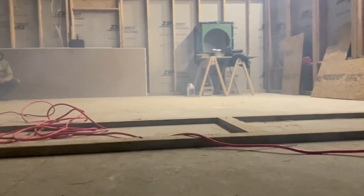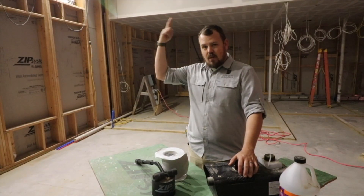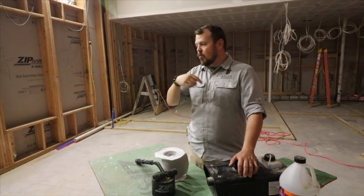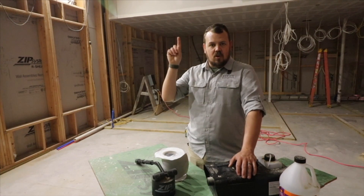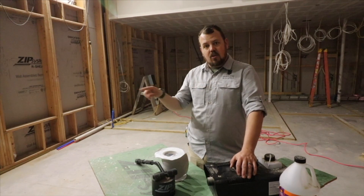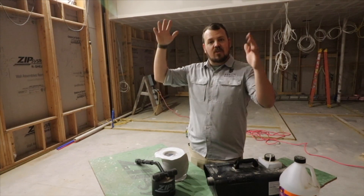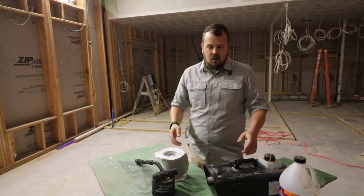So for us, like behind me, we have our air barrier on our flat ceiling. We'll have somebody go in the attic, and then we'll walk the perimeter of the house. We'll get up on a ladder and look in the eaves, and hopefully we can find any large holes with this. We've used this to find light fixtures that didn't get foamed or caulked in place, and we've also used it to find a leak around the sill — which I was a little surprised, since it seems like it should want to force air up and out first, but it works.